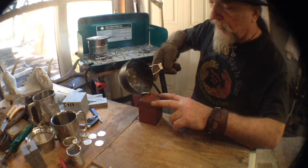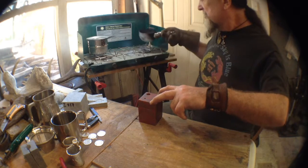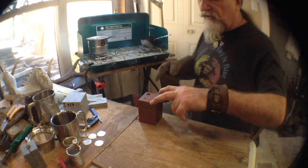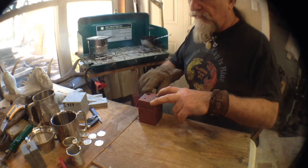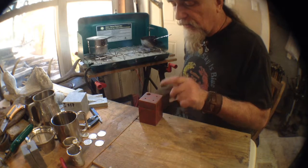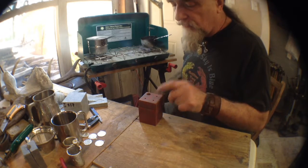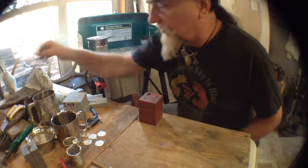Once I've started my pour, I'm going to make sure it stays pretty steady. All the way up. There it is. I can see it. What I'm looking for there, of course, is to see it just coming up into the pour hole there. And right now it's doing that nice little trick where it's just nice and shiny. We can see it. It's wiggling a little bit in there. It's starting to go hard. Now it's frozen solid. So I'm going to give it a few seconds here.